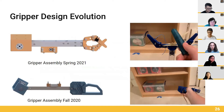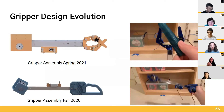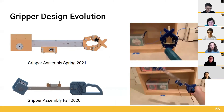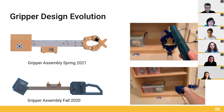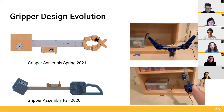Alright, so on the bottom left you can see our design from last semester, and on the top left you see our design from this semester. We have made some changes to the Gripper, but the designs function in similar ways. The arm is directly powered by a servo, allowing it to rotate up and down, and the claw opening actuation is driven by a servo with a pulley with string attached to it. The claws are pulled closed with surgical tubing.